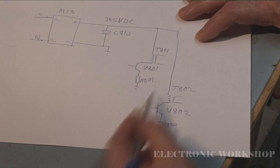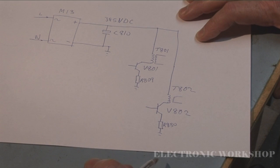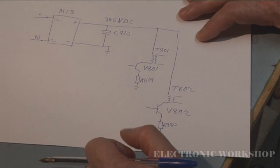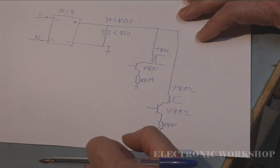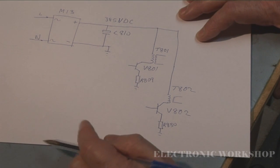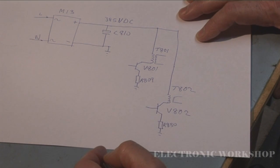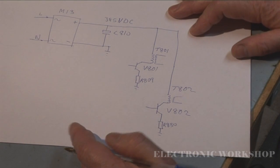We have our output transformers here, our smoothing capacitor here. These are all components that could be given breakdown of insulation. I'm not saying it is breakdown of insulation, because I've also seen a short on the secondary side do this as well, where you've got a fuse rated at 4 amps and the current is more than 4 amps, but not enough to trip the overcurrent protection in some poorly designed power supplies. But that would be rare. I have to check this insulation first.